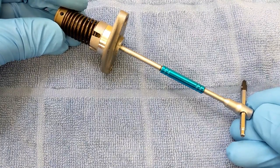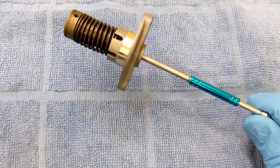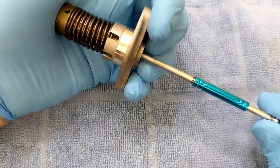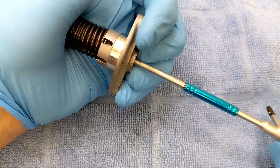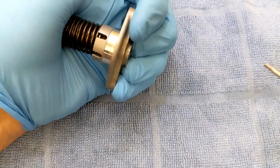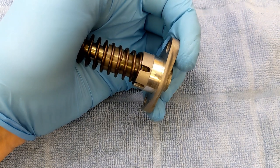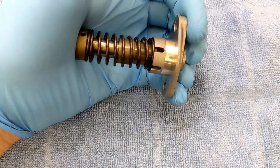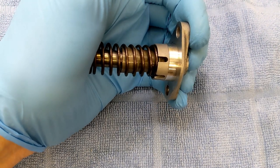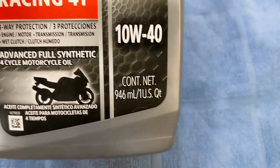So we have this turned fully counterclockwise. If I just pull this key out it would fly out. What you want to do is keep the pressure on it — you heard that click — then pull the allen key out and see if it releases smoothly, which it does. Once it releases, it won't go back the other way. You just have that sixteenth-inch of play like I showed you before.